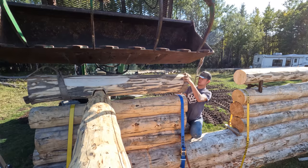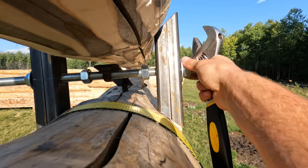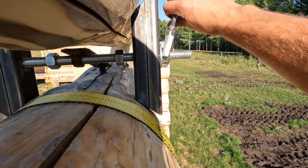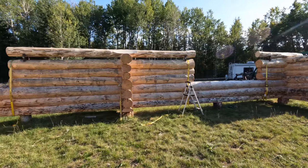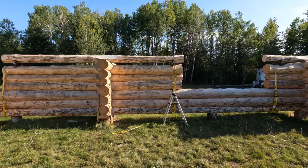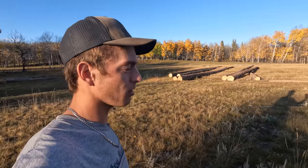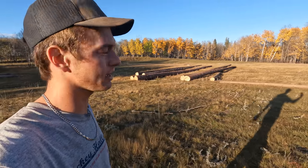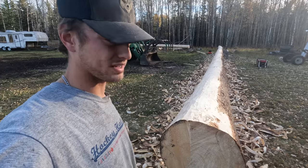Lining them up and dropping them down — just out here solving the equation. I fabricated these to hold up the ends of my logs. This log is in three pieces, so there are six ends that need to be lined up perfectly, up and down as well as side to side, so they stack up with the logs below. I've been spending most of my time in the bush getting these monsters dragged out, cut, limbed, brought home, and peeled. This is a straight log for over 60 feet.